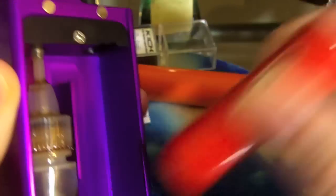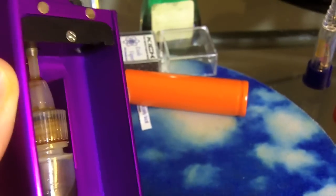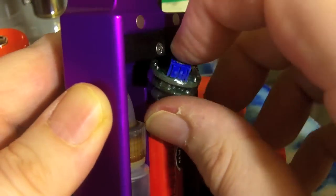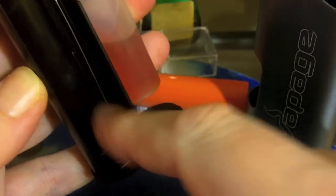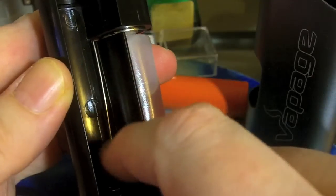You can Kick an 18650, which will last a little longer than an 18500. The Rio Grande — they are metal, and you can easily fit the Kick in here on top of an 18500 battery. The issue is that it's a block of anodized metal, so what you would have to do is see where the Kick sits, where that ground spring needs clean metal, and sand the anodization off there a little bit so that it would make the ground connection. Another thing I've seen people do — I have not tried this — is with the Vapage Vmod XL, I've seen people run a thin sheet of metal along to ground by that bottom spring so that there is metal up the right side for the Kick to hit and make a ground.